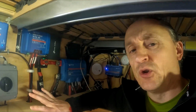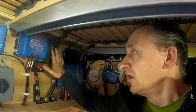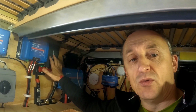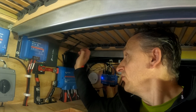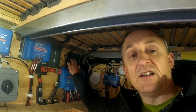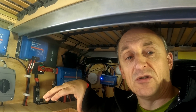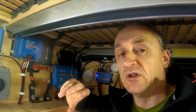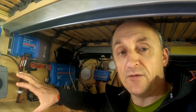I'm now in the garage and I've organised the routers. I had to do a bit of manoeuvring stuff around to get it in. So I've now got the main brain router, which is going to be this one here, which is going to be doing all of the offloading between the 4G and the Starlink. And then on the right hand side there is the one that's going to be handling all the Wi-Fi. Now again, the reason why I've done this is because whilst the Nighthawk is a decent router, it does seem to be struggling with how much I'm asking it to do. So I'm literally going to switch over to using that just for 4G, and it will only do that. I won't worry about the Wi-Fi or anything like that.